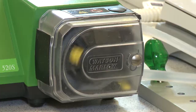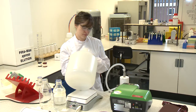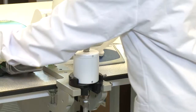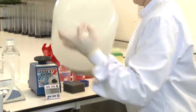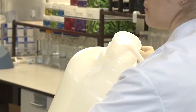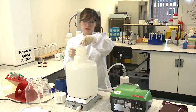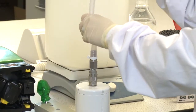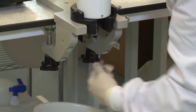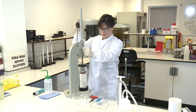Start the pump to commence filtration of the rinse. Perform a second 1 litre rinse, ensuring that any residual liquid is transferred to the filter. Disconnect the tubing from the filter housing and proceed with module elution. Once sampled, FilterMax modules should be eluted using the FilterMax manual wash station.